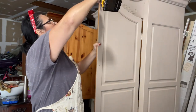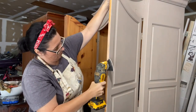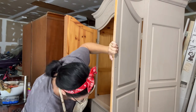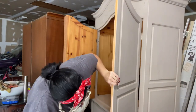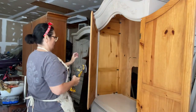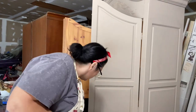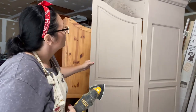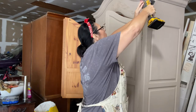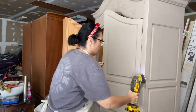The places where I had a couple of kind of globby spots, I just go over it with my sander. I use like a 240 — very, very light sanding and I barely touch it. And there are a couple of spots that I like to wear down to the regular wood to get that paint off, just to give it an old distressed look. I just kind of do it here or there — there's really no rhyme or reason. Because you can always cover it up if you don't like it. Like right where I'm at now, there was a little bit of a globby bit of paint — it came right off with that sander. Nothing we can't fix.